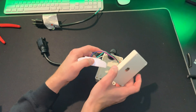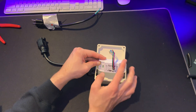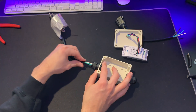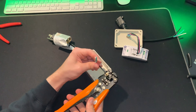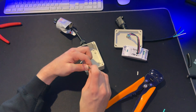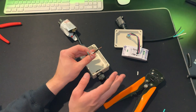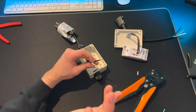The way this is going to go inside the case: we have the input here and the output here. Start with the input, which is going to be the voltage. Remove the Sonoff for now and slide the wire into the gland. Then strip all the ends of the wire with your wire strippers. I like to twist the ends so everything is nicely contained — do that for the black and white wires. Warning: we are working with high voltage and this will be used in high voltage scenarios, so proceed with caution and at your own risk.